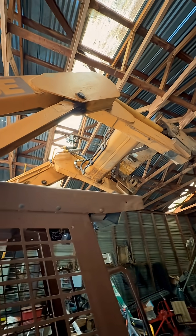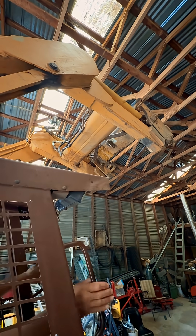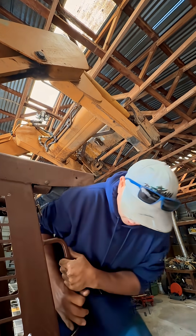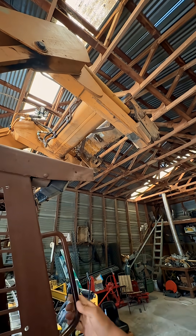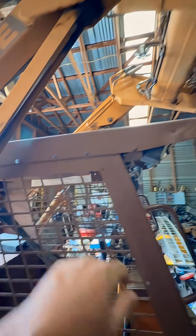See how high this implement is? If I want to get out of this machine and for whatever reason I accidentally hit this lever, or something failed, this would literally come down and crush me. If you want to get in an area and work underneath where all of this would smash you — and I guarantee somewhere in your life you will see somebody with these arms up and the safety not locked in — they're in the danger zone.